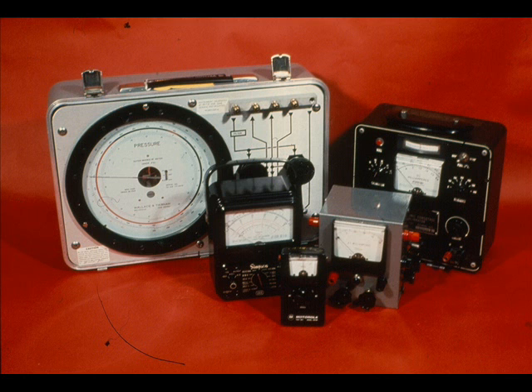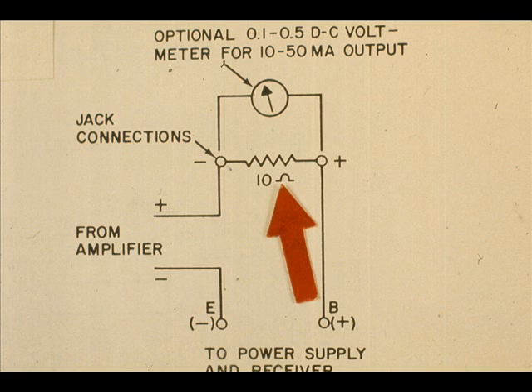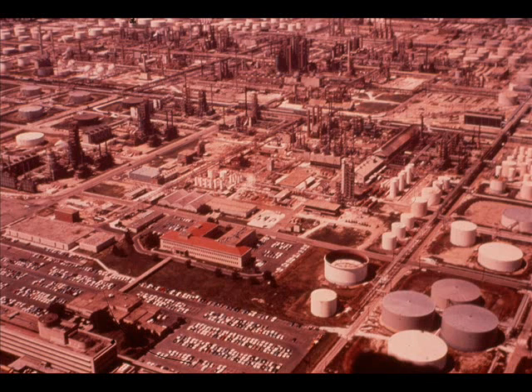In the final analysis, the degree of accuracy of any calibration is dependent on the quality of the calibrating tools used. The Exxon gray box calibrator is entirely satisfactory for many installations. Some transmitter circuits have a precision resistor located near the transmitter — a digital voltmeter or a millivolt box connected across the resistor will give satisfactory readouts for zero and calibration purposes. There is no clear-cut calibrating procedure and selection of calibrating tools for all plants, nor even within a given plant — a judgment is made for each task.